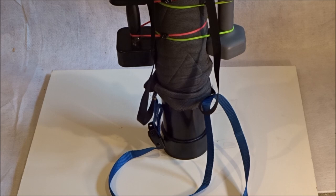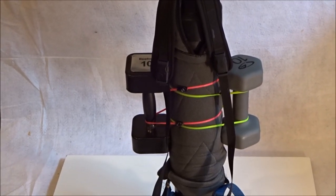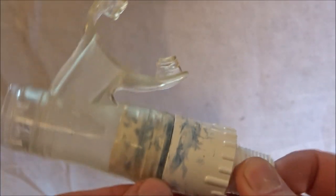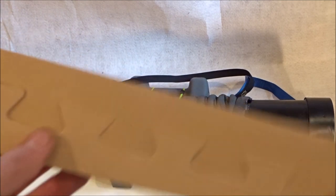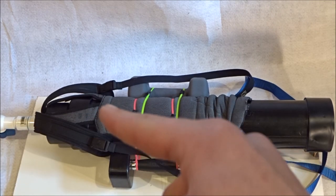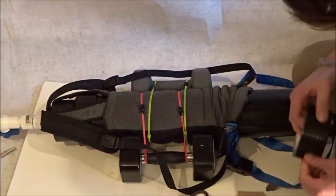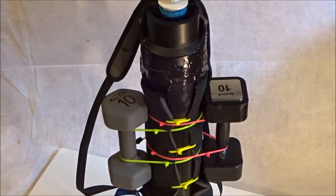Next, the tube itself is hard, so I'm going to put foam on the parts that are coming in contact with my back or my tailbone to make those softer and more comfortable to use. For the mouthpiece, I've just taken the reducer and a part of PVC pipe sticking out of it and attached the mouthpiece — this works perfect. For the foam, I'm going to take some EVA floor mat foam and place it in areas that are poking onto my back. I've marked those out, and I'm just going to put duct tape around them because zip ties get pokey when you cut them and duct tape just works better.